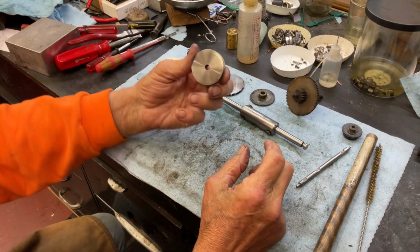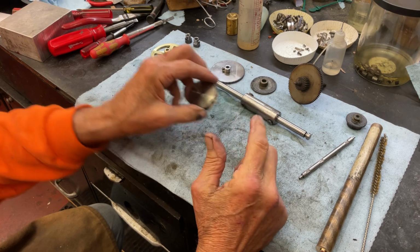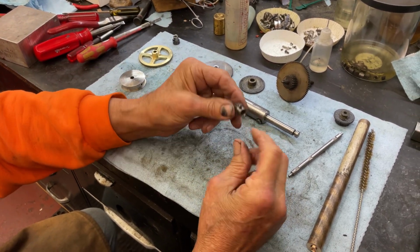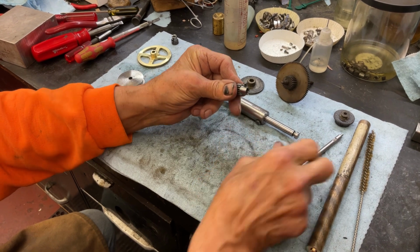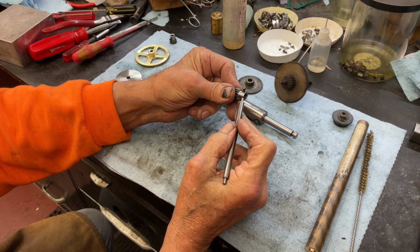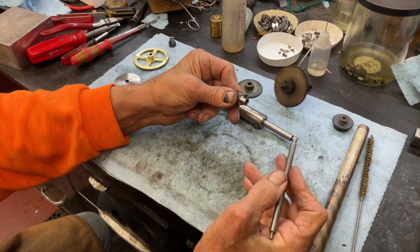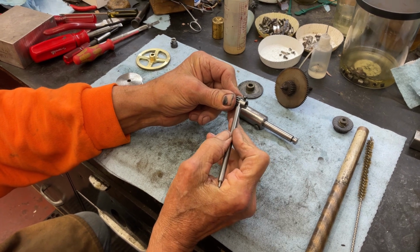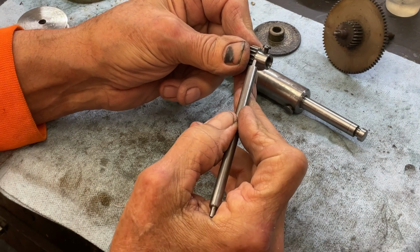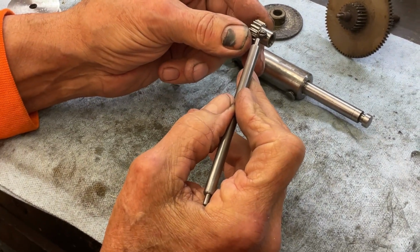I did the same thing with the pulley. Those are nickel plated. You can see the reflection in here. I've cleaned all this out and polished it. And then these gears here, the same way, flex-honed. And then on these, what I did for the customer was, usually they would just take the lathe and go whap, whap out with a cutter bit. So you have the carriage that goes, and they leave these little straw-colored lines because they didn't care about detail on a motor. And then I cleaned those up and re-blued all the screws.